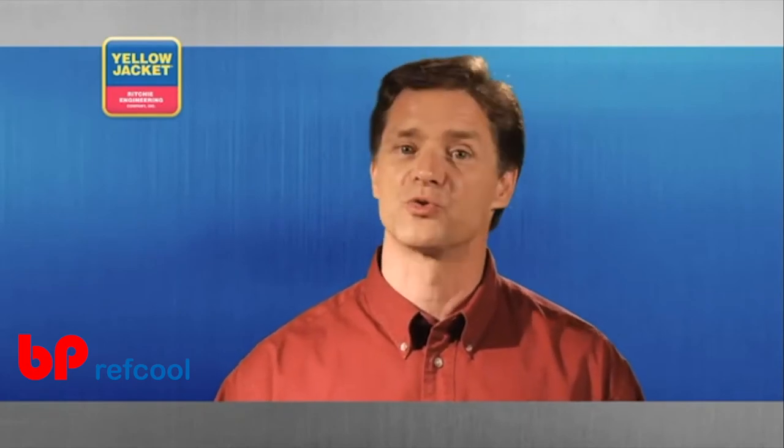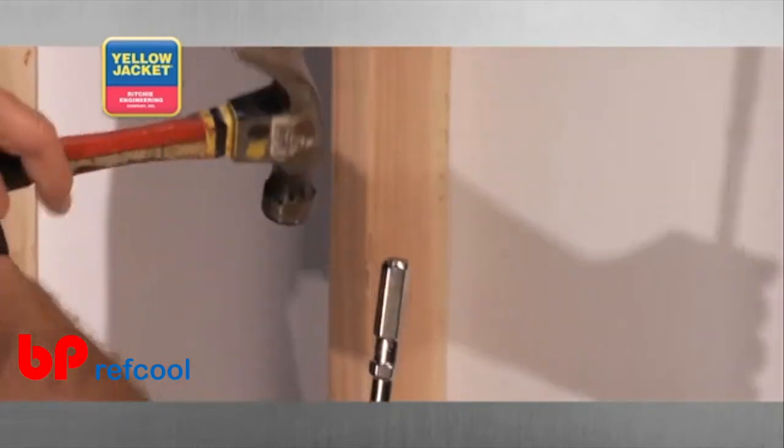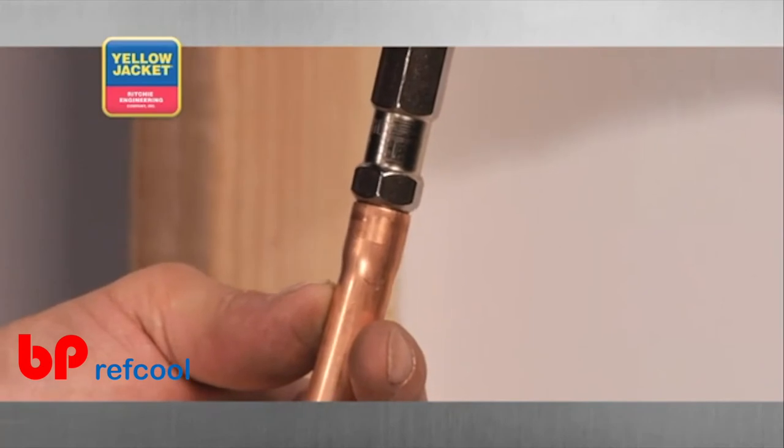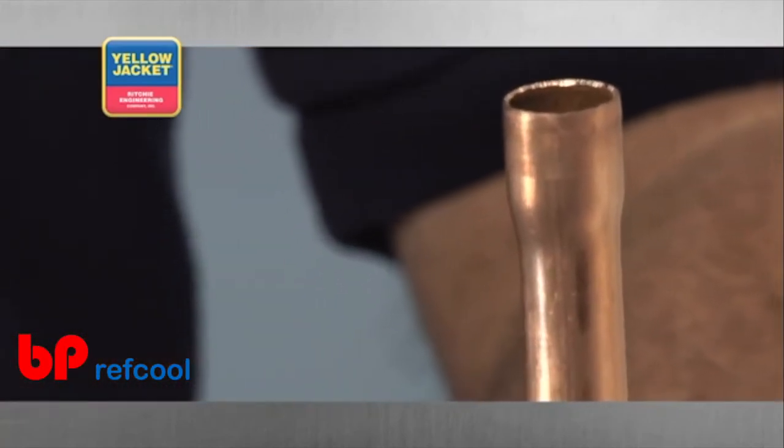A common mistake is to drive this into the tube at an angle. While gripping the tubing tightly, use a hammer to strike the punch, driving the swager into the end until you reach the stop and have achieved the form you're looking for.